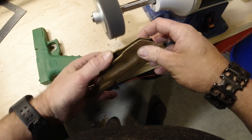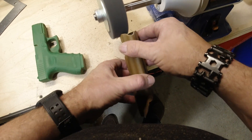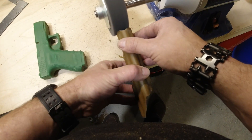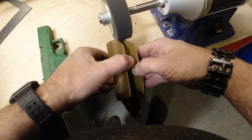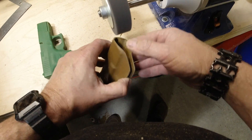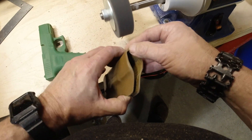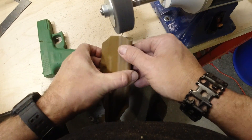Then we're just going to go to a flap wheel, and this will really get it nice and smooth. If you use 800 grit and you're gentle with it, you can even get some polish out of it. Or you can move to a polishing wheel and rouge if you're concerned about getting a mirror finish — you can get kydex, Boltaron, and Holstex all to a mirror finish if you want to put that much effort into it. Completely up to you.